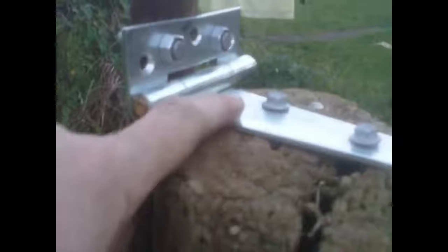It's the end of day 838, and look, the pole is up. Not just leaning against it, but the actual pole that the wind turbine will be on. The bracket's complete. I actually had to take out that lag bolt and replace it with a very long, I think it's actually kind of a drywall screw, because of course these come down and fouled on there. When I tightened up these nuts, that's kind of bent a wee bit, which doesn't affect the operation of the hinge, yet it snugged that in down really good.